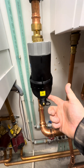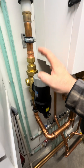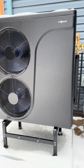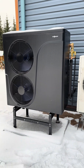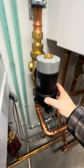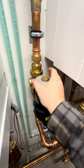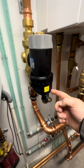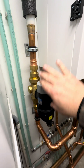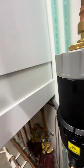It has a filter media inside, it has a magnet inside, and it's going to collect incredibly small particles to keep the outdoor unit — which has a flat plate heat exchanger — protected. You can flush this out; it's self-cleaning by turning this here. Any debris is going to fall to the bottom of this canister. This can actually be installed vertical or horizontal because it swivels right here.